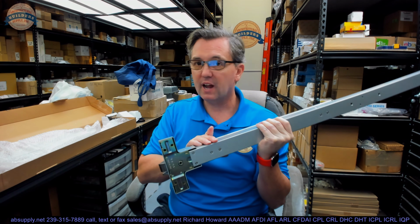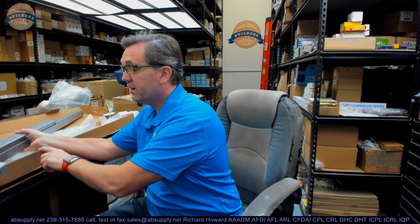Now, this device, and I'm not going to name names, although I would like to, was returned to me by a client who couldn't understand why this deadlocking tab, the little, smaller latch, was always sticking out. It was making conflict with the frame or whatever the imagined problem was. And exploring the client's problem through the technical support call that I was on, the deadlocking tab is sticking out all the time. So the question is, do you have a strike installed?